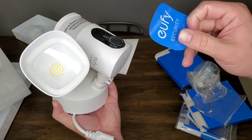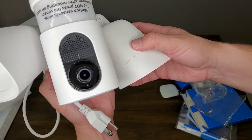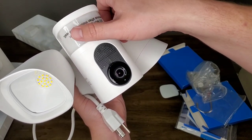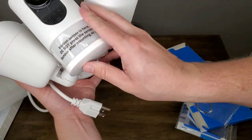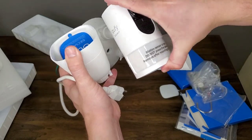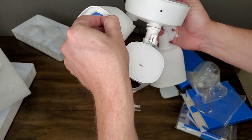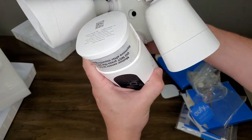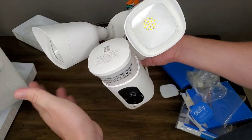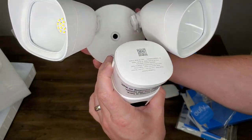Go ahead and pull the cover off — you can check out the LED lights. They are super bright, as you'll see in the footage later in the video. Don't take that sticker off until you get it installed and everything in place — that's the sensor for the motion detection. You can adjust all the lights on each plane, vertically and horizontally, so you can turn them all the way around and put them at whatever angle you want. Everybody's driveways and front of their houses are different, so it gives you the flexibility to point and direct the lights how you want.